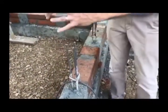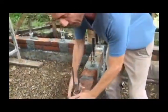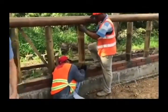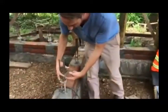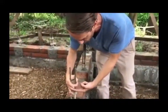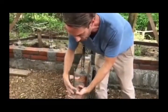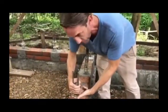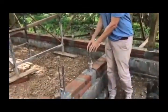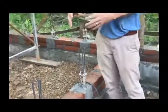Now the bamboo will come on top over it, and as we can see behind them, Juan Jose and the others are taking a piece of threaded rebar and going through. Later on we'll have another piece of 1/4 inch metal going around here. The bar is going to come through here, and once it gets filled with cement, there will never be any uplifting of the structure. It's literally anchored into the ground. You don't get to see all the mechanical parts once it's made. You see how the bamboo is getting anchored into this, and it's the beginning of the footing of all the bamboo.